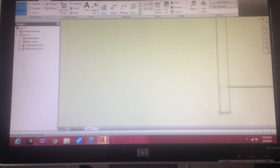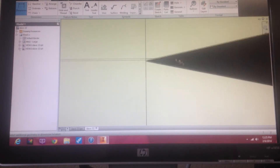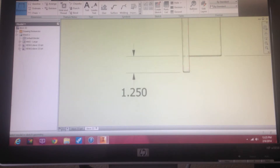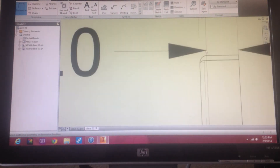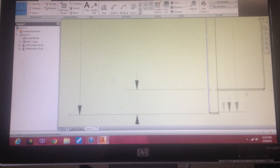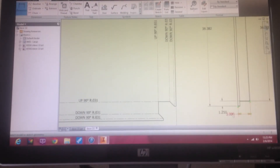Well, I got 1.251 — you know why that is? I picked up to the notch. So you remember I have one thousandth inside there, so it's picking the right line but I got the wrong one. There are two little lines in here — if you zoom in, that's the one that's going to be 1.250. Now one thousandth isn't going to probably make a lot of difference to everybody, but again just the idea that if you know what you're trying to do, you control it. There's my overall that shows what it should be, and my depth here.